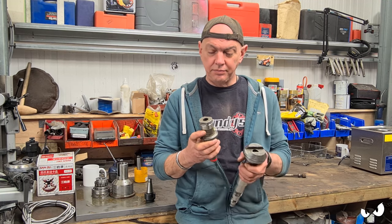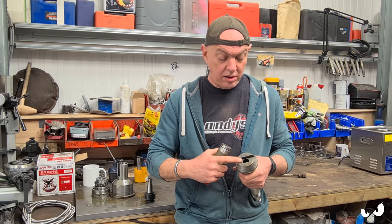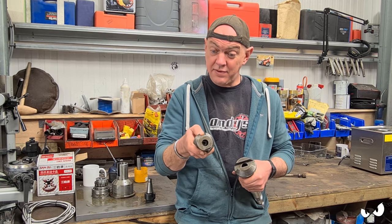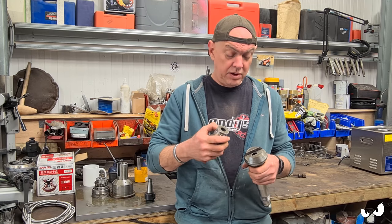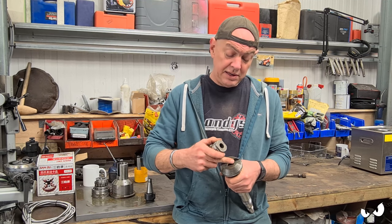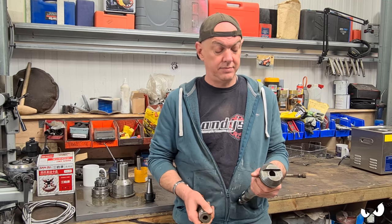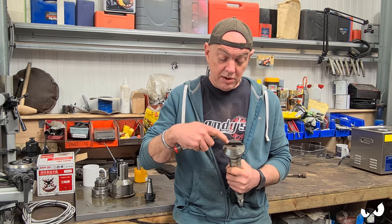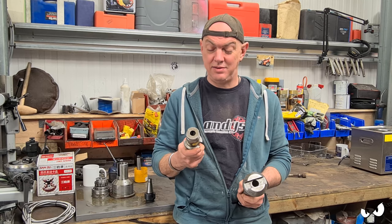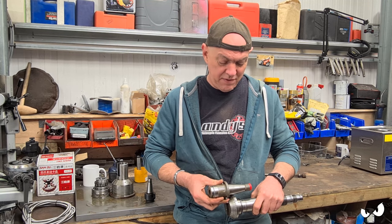So the other option that I've got is what I've seen on some other machines, in that you drill a hole there and there, machine up a block that is this width on one side, and when it comes to this surface, it shrinks down to fit into that groove. That way, we could machine an International 40 taper in here instead of an International 30. That tool would slide in and sit down on this face, or just shy of it, and it would engage in these two dogs that are screwed in here. And that way, all I'm doing is putting a different taper in there and drilling it for the blocks, and that would fit. And that's bigger. And I like the sound of bigger. Still got loads of meat to do it. We should be fine on that one.